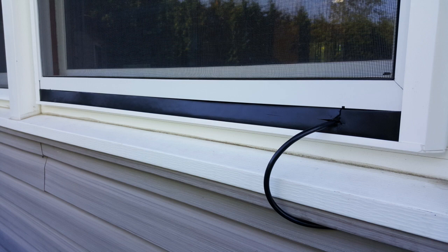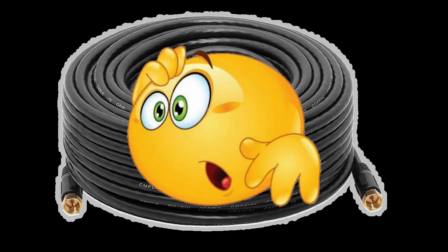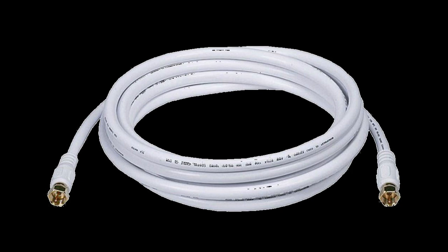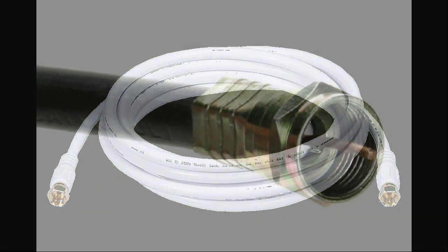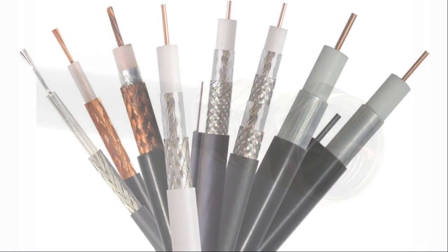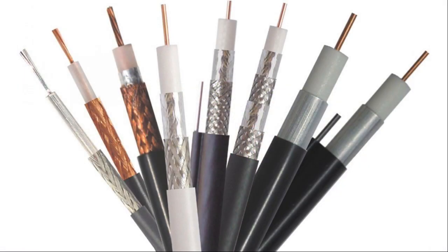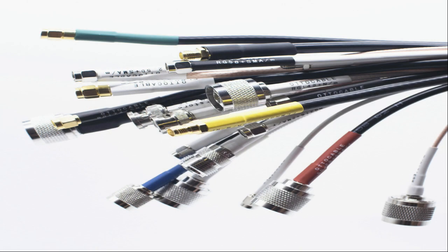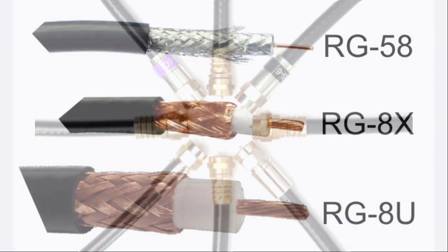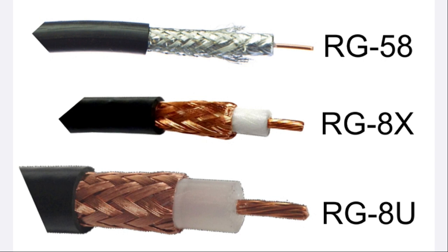Coax cable is a whole conversation unto itself. As a newbie, I had no idea what coax to use. I knew I had a ton of coax from cable TV applications, but fortunately for me, the connectors are completely different, so I suspected correctly that I should buy new. See, they have us newbies in mind. So I knew that I needed 50 ohm cable, but wasn't prepared for the fact that there were so many varieties available. Do I get RG58? RG8X? RG8U? Something else entirely?